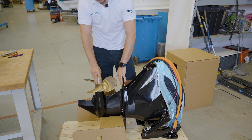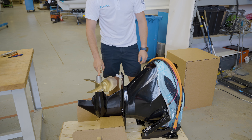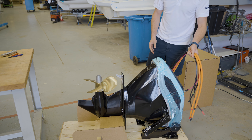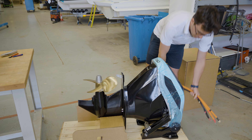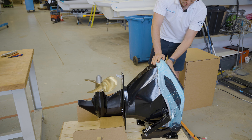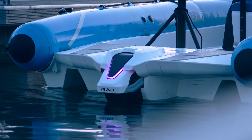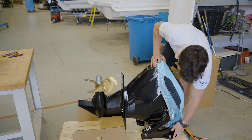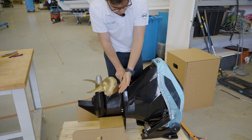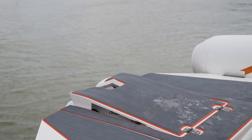In terms of maintenance, there's only two anodes — there's one here and one here. Very easy to get to, very easy to replace. Cables obviously come out of the front of the drive — these are what go into the boat itself. And then you've got the viewport window — this is mildly opaque dark tinted plastic on the back, and you get an LED strip around here. The mounting system is the same as any other normal outboard, so you'll be able to use the same conventional holes, and it's got trim rams so that you're able to trim up and down just like normal.